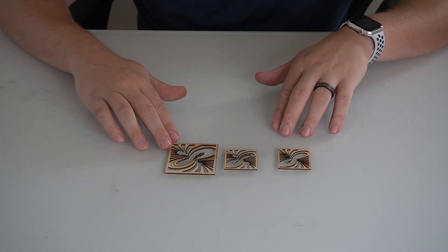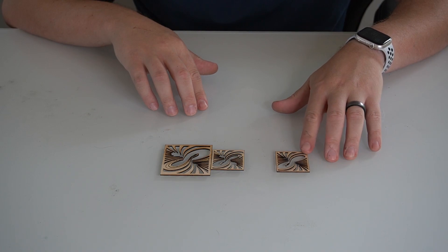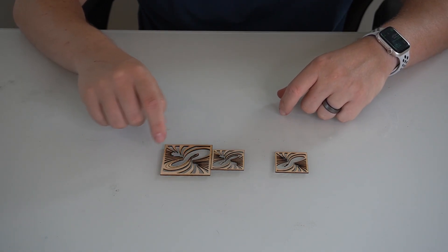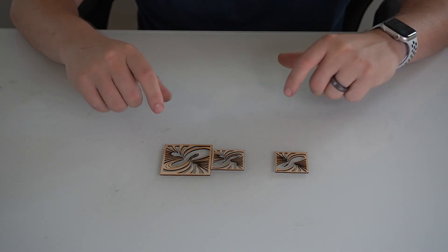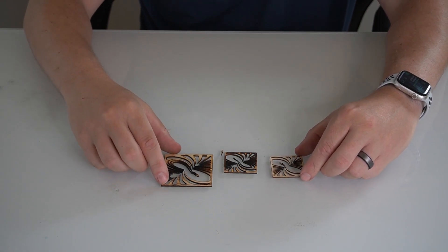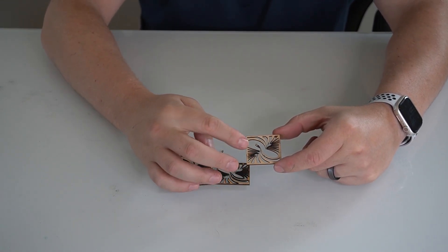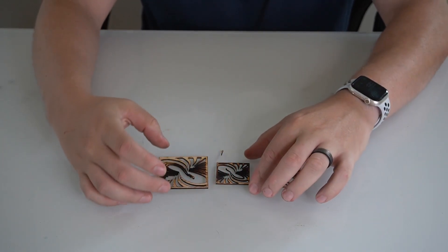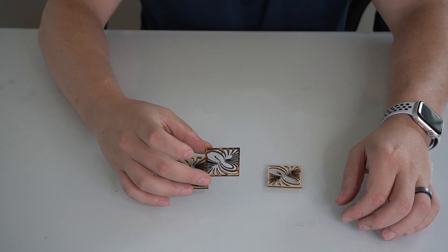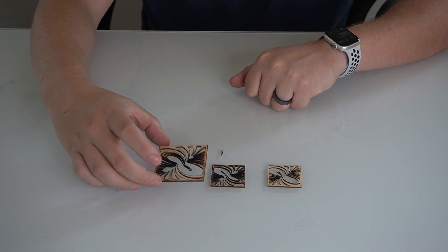Here I have a couple of examples with eighth inch basswood. From the top you don't really notice too much of a difference — these two I did with just the aluminum bottom, and this one I used the mesh. It's also worth mentioning that a lot of these pieces just fell off because the material is so thin. But the big difference is on the bottom of these cuts. You can see on the mesh one it's a lot cleaner, but on the aluminum-only ones it really just looks burnt. So if you care about what the bottom looks like, the mesh does help quite a bit.